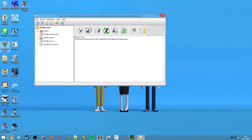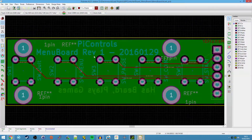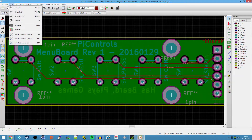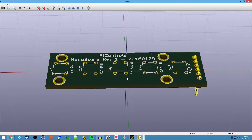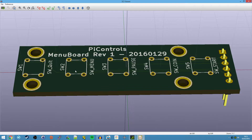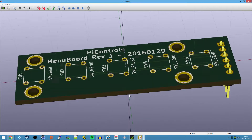Let's have a look at the second one. I haven't quite figured out KiCad yet, so at the moment I've just got all of these saved as separate project files. This board here - let me go into the 3D view, it's probably a bit easier to see. This one is going to either sit above or below the screen. As you can probably see, we've got buttons for Quit, Menu, Pause, Insert Coin, and Start. Again, these all come over to this 6-pin, 0.1-inch pitch connector over here. I'm not going to use pins - I'm just going to wire directly to that. So that's the second board.